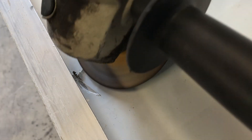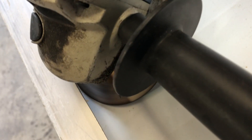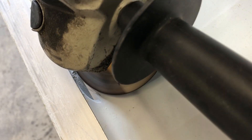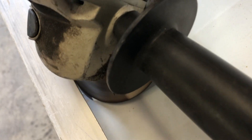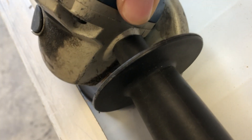At the other end of the panel I needed to expose the bus bar that connects the first half of the panel with the second half. We'll cut this and bend the tabs up so we can solder it in a second. I think you could get at it effectively without a grinder, but it was available and it was 100 degrees in the warehouse so I just went to town. Thankfully there isn't a solar cell behind this bus bar, so not much to damage here other than doing the unthinkable and breaking the seal, which is the back sheet.